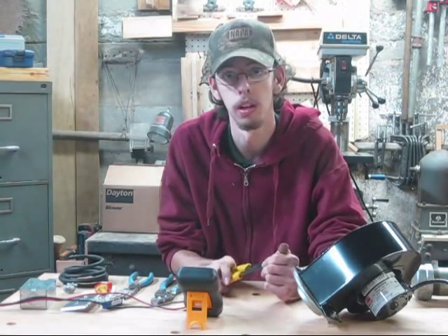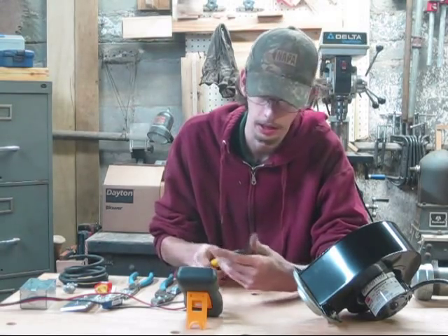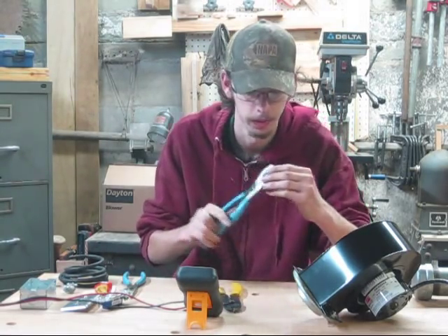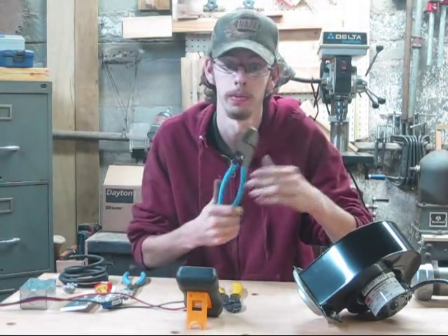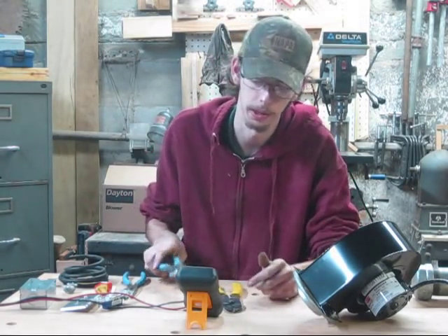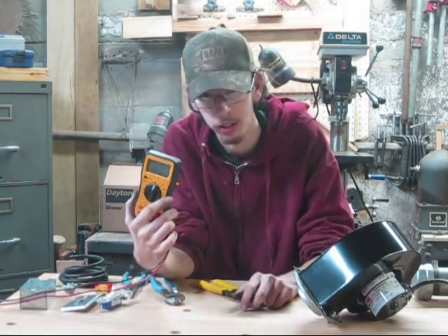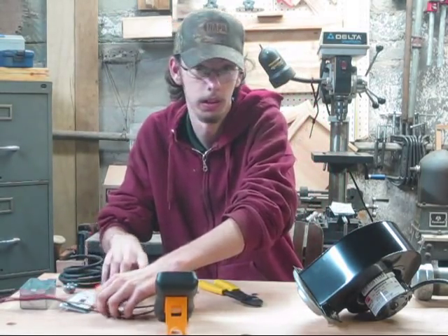You're going to need a few basic tools to do your wiring for your blower. You're going to need a pair of needle nose pliers. You don't have to have these — they're not a requirement, but they do make life a lot easier. These are heavy gauge wire cutters; they cut on all sides and they're real good for this wiring that we're cutting. You're going to need a pair of wire strippers. Also, a good multimeter doesn't hurt. You don't have to have it, but it doesn't hurt to check your voltage and make sure everything's running correctly.